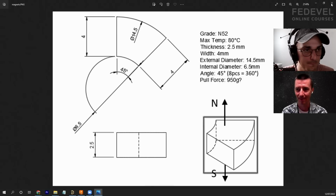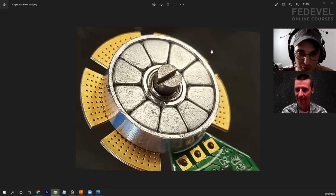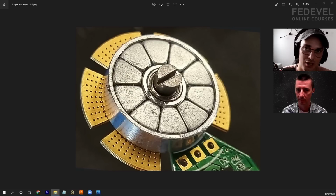And how did you make the other pieces of the wheel? Do you have a CNC machine or something? So for this one, first I started using an aluminum rotor, which I have a small CNC machine, which I made myself. And then I started experimenting with using an iron rotor, which improved the efficiency and the torque of the motor a bit, because it helps concentrate the force on the bottom sides of the magnets. And then I switched to a combination of iron and aluminum. So I have a small plate and an aluminum housing. Wow.